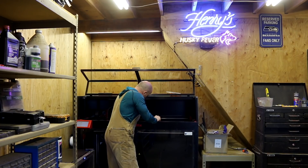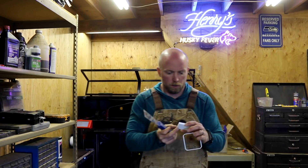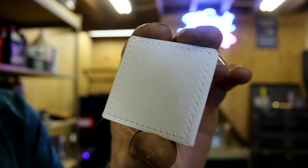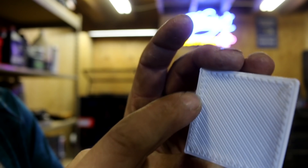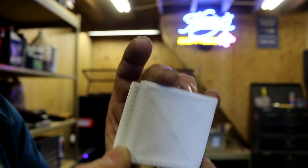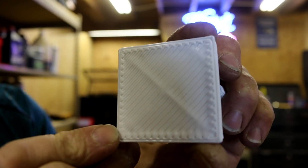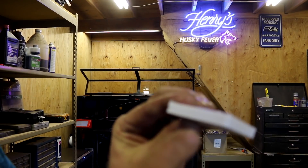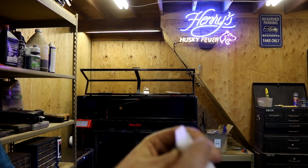This likes to stick right to that bed — but it came off. That's not bad at all. So this one, we added more layers to it. It has five layers on top and bottom — you can see they're almost folding into each other there. This is two layers on the bottom and three layers on the top as our previous print. For what it is, it really isn't horrible. But we've got some problems right there in the corner — might be going too fast still.